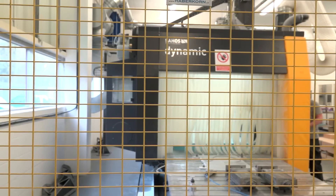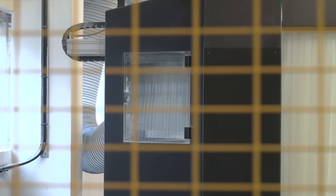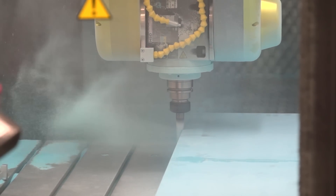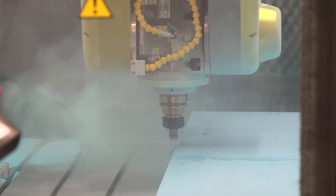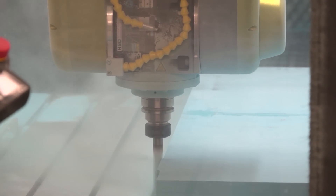It's quite neat the way it works as well, because it blows the dust into the extractor too on this machine. That's right — there's a two-stage process. We put a big vacuum extraction system on the back which takes the airborne particles away. We know that some particles are going to be so heavy that if they settle on the bed the extraction system won't be enough. So we've set up a blower on this side that keeps these particles airborne and actually directs them into the extraction duct, which helps us achieve the clearances we're managing.